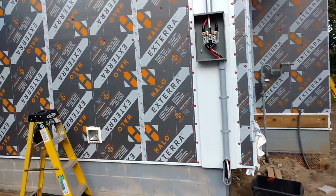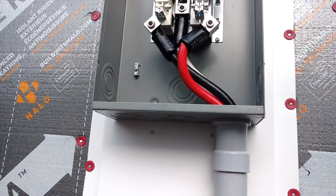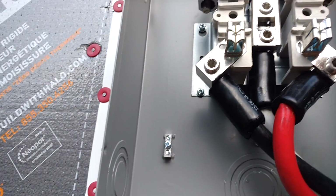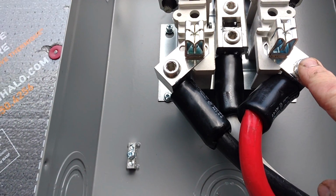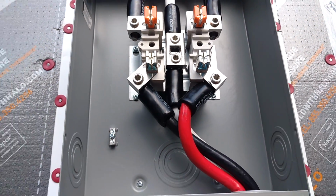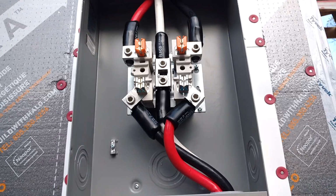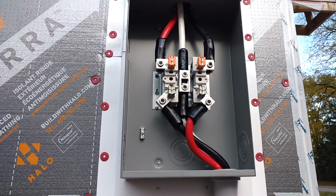So what I've also done here is there's something in aluminum conductors called cold flow. It's not inherent usually in copper conductors. What happens when you go underneath a screw lug and tighten down on the conductor, I'll show you that in the basement, the aluminum starts to want to chase away from the pressure. Every time it does that, the connection loosens up, and you have the potential for arcing, and arcing is something you do not want. So all my connections here, I've got compression fittings on, and I'm going to go into the basement now and give you a rundown on what all that entails. So just give me a second.